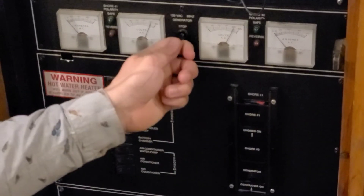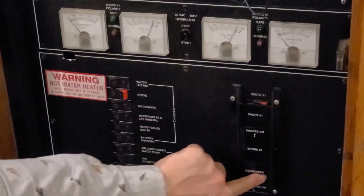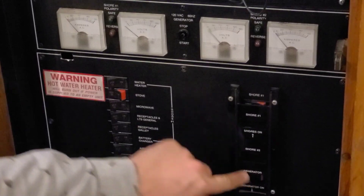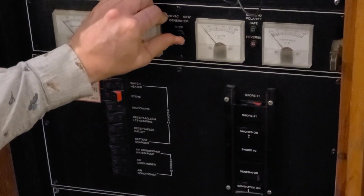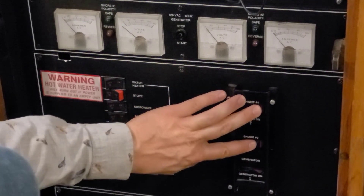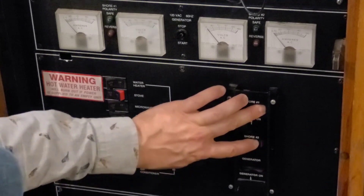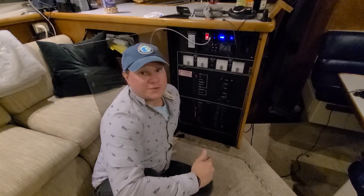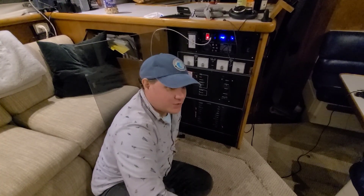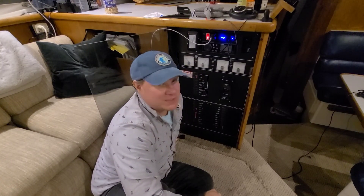Generator's working. It sounds great. It's holding steady voltage and I'm very happy. And before you shut it off, always make sure you disconnect it first, then stop it. If you don't disconnect it first, you can damage stuff — I have forgotten before, and it probably usually won't happen, but it can cause damage if you're not careful. So there you go — now we've got a working generator. This is Will Steele with DIY Boat Life. We'll see you later. Bye.